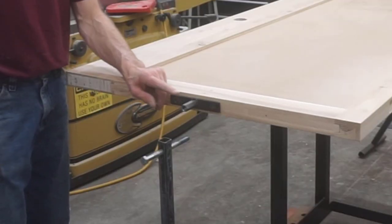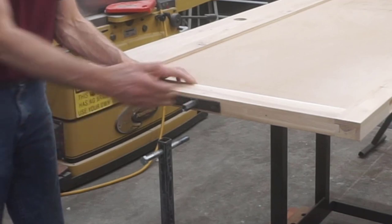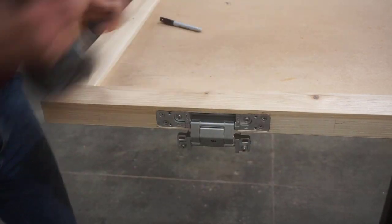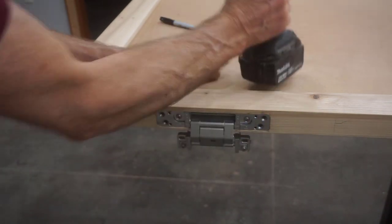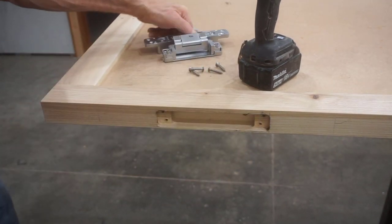One more step I do before final sanding of the door is to install these special little pivoting brackets, one to the top and one to the bottom of the door. Naturally, I need to remove the beefy Sugatsune hinges from the edge of the door before finishing. I take a second to label them B and T for bottom and top, so that the minor adjustments the hinges need to make the door hang and swing properly are preserved.